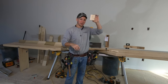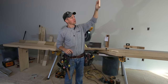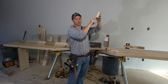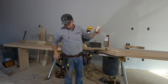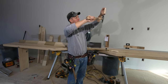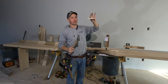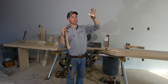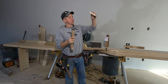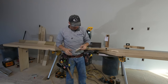This is an offset block. This measures the projection down that my crown will be on the wall. I'll stick this up against the wall, mark the bottom, and then I can chalk the lines from this block. I also use this block to hammer pieces into place, which works really well. Or if a piece of crown is not wanting to go to your chalk line because of a butt joint or drywall issue, you can put this block up and hammer it into place.